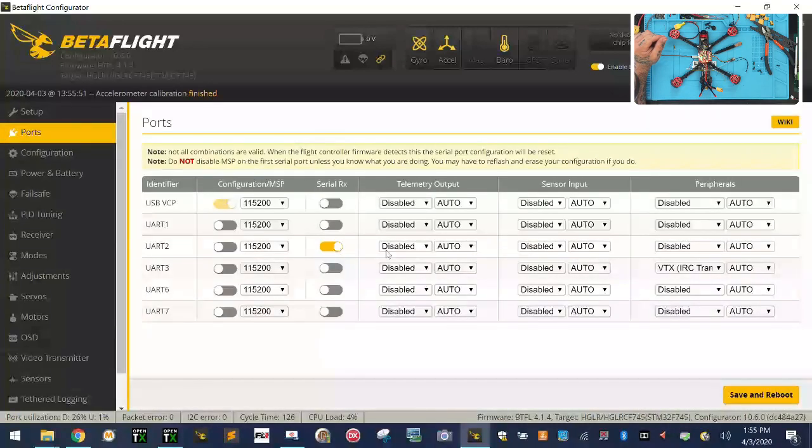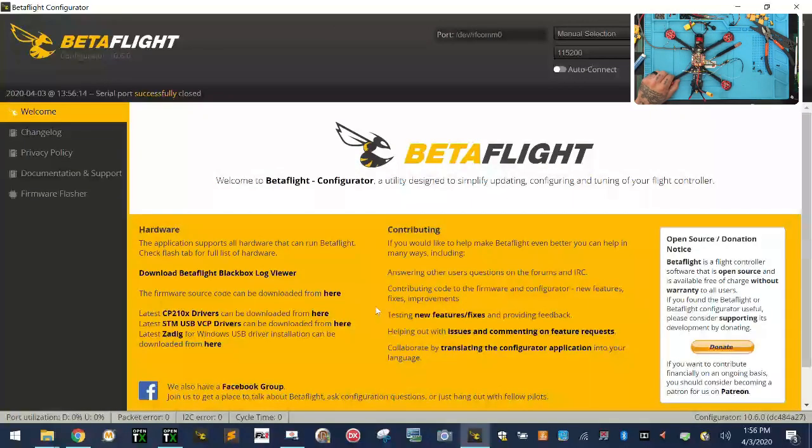Okay. All right, so I'm going to go ahead and I think I should be okay. Got our smart audio configured. I guess I could use TX6 if I wanted, or TX1. I'm going to use TX6, so let's go ahead and find that real quick. And TX6 is going to be over here somewhere, I believe. Hold on, where was I looking at it? Nope, it's right there. All right, so I'm going to go ahead and tin up TX6. Okay, so let's do that.